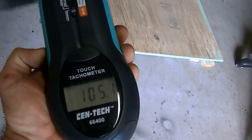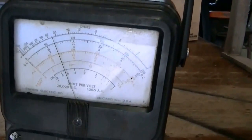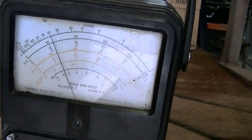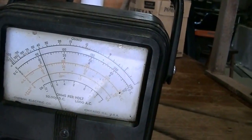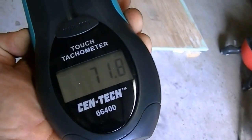I'm doing an RPM test — running about 100 RPM, and we were getting about 14 to 15 volts. I only got it hooked to one phase. Now it's about 12 volts and we're about 75 RPM.